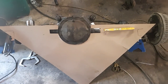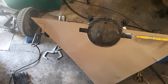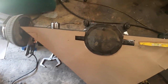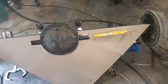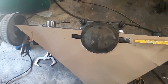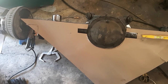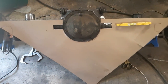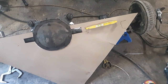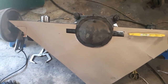So now that I got the basic frame laid out, tacked up, I got my template up here. I just cut me a straight piece across on my cardboard. I'm gonna line that up with the edge of the steel. It'll save me a lot of cutting, and it'll leave it straight. So now I'm kind of just going from the back side and making my mark along my angle down there on the bottom, or my channel, I should say. And then I'm gonna cut it up. And hopefully it'll fit good. If not, we'll keep on trimming.